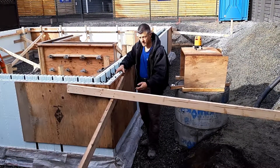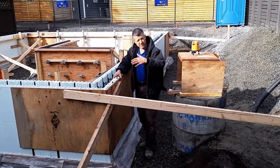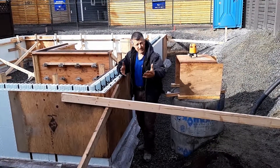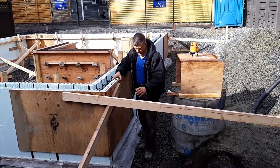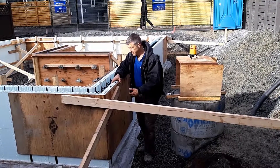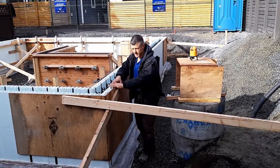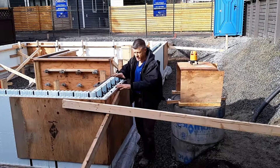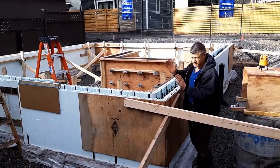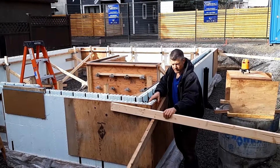There are other ways to do it — you can go a long ways and try to slide them underneath. I don't think you should put the steel in before you put the blocks on, because the bag is harder to move if you need to adjust it later. So: line up the bag, get your footing set, put your steel inside for your footings, and then from there go and shoot your foundation level all the way around. Get it in a pretty good place, and once you square this up — on this particular one we squared it first — you've got the corners.